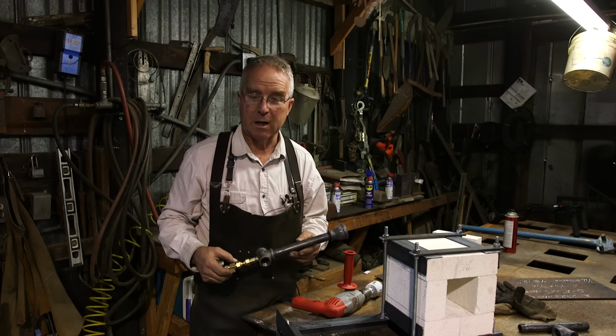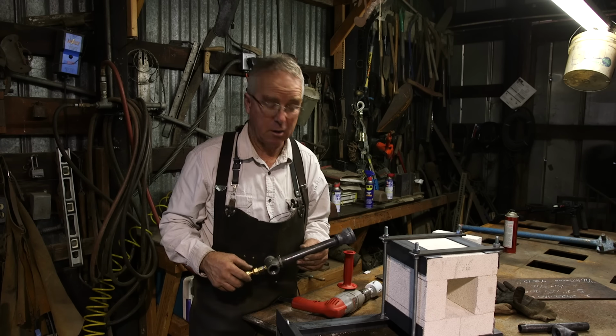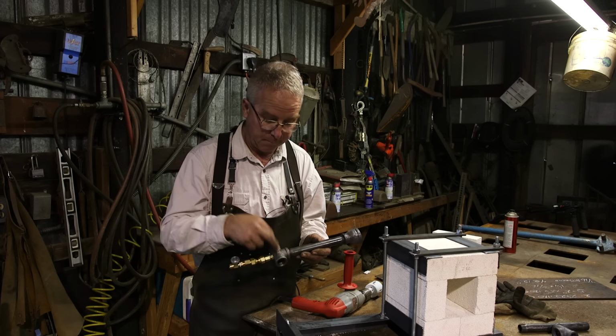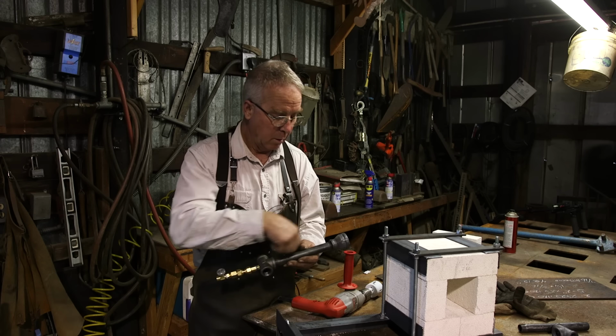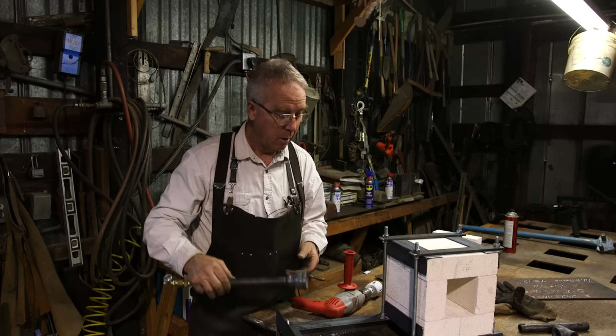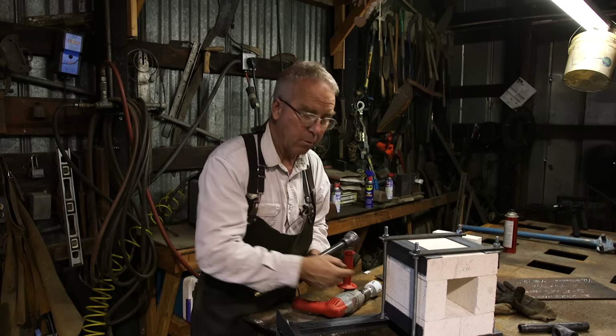This is a burner that I took out of a different forge. I bought it online on eBay. There's a lot of them out there. You can buy them. I think I paid $70 for this. It's very simple. 3/4 inch pipe, a T, inject the fuel, 9-inch nipple, 3/4 to 1.25 bell reducer, drilled in through the side. But you drill whatever size hole your burner is right through this fire brick.